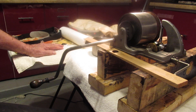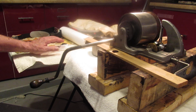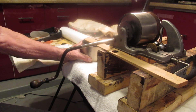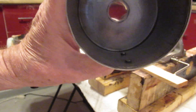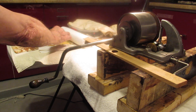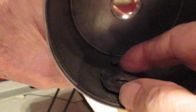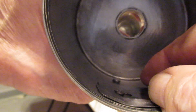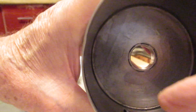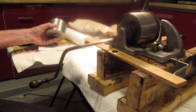In the process of that happening, it broke what some people call the rivet, also called the spring hook. For those of you that don't know, inside you see those little rivets. Let me get the spring again and show you — you can see how the spring hooks onto that spring hook and then winds around and around. Well, this one was broken.